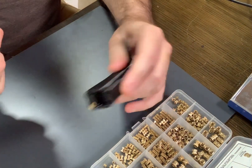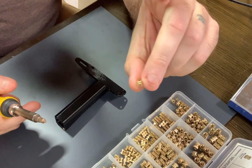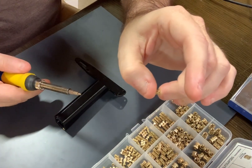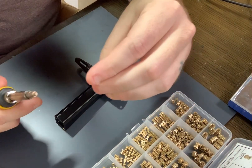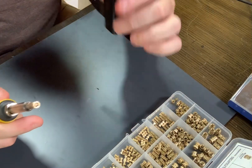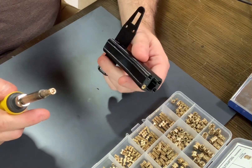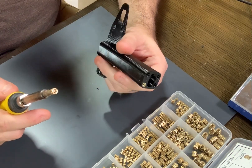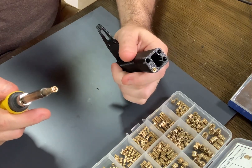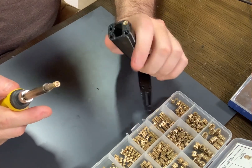Just keep doing that with all four holes. The other thing that's important is to use the proper length insert — too shallow might not be strong enough, and too long will go past your 3D printed area and might pop out of the perimeter or top of your print. Again, 205 is the temp I'm using for PETG. If you're using PLA, you'll want a little lower temp, probably around 170–175. If you're going into a higher temp material like nylon, you'll want to up the temp to about 230–235. You're just trying to get close to glass transition, a little above, but not to extrusion temps.